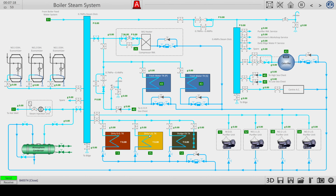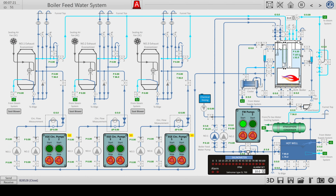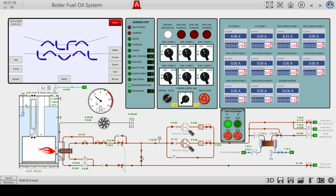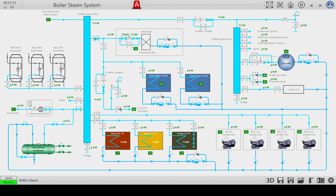Paddling back to the steam system, my boiler is just coming online. Over here I only have 4 bar. I'm going to open the main steam valve. That should be enough, I think. This is the system for the heater. Let's put this in the right position. There's a reducer to 4 bar, and we can also use it to heat up the water. But this is the main part that we need to look after now.